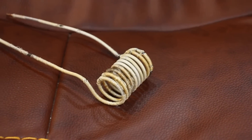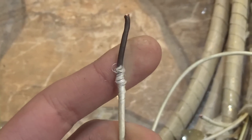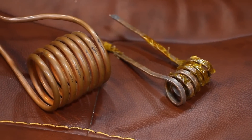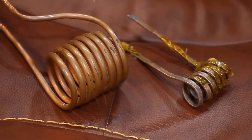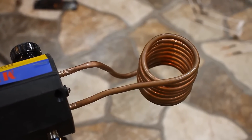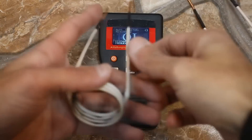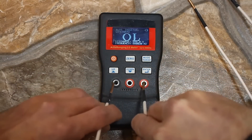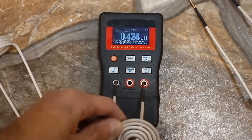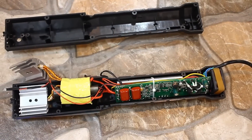You can wind the inductors yourself. It is not advisable to use wires with a diameter of less than two millimeters. It's better to use a pipe or a bus bar. If you set up water cooling, the heater can safely operate for a long time. The inductance of the complete inductors ranges from 0.3 to 0.6 microhenries. I tried different inductances and the optimal is around 0.6–0.7 µH, although the device is not critical to the inductors due to the use of a decoupling transformer.